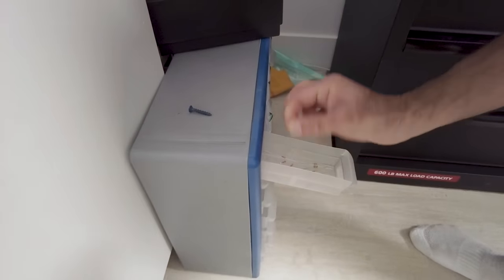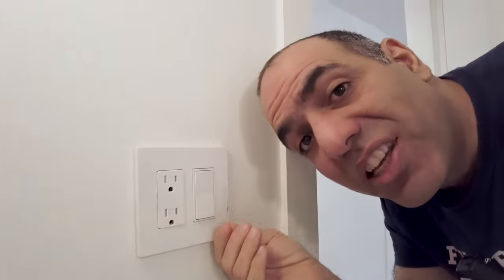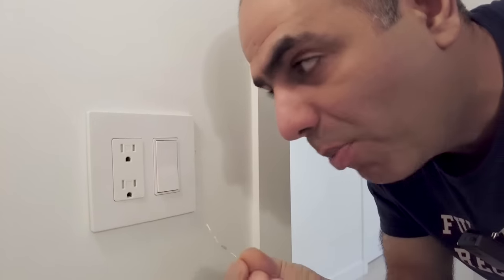It would be a pretty safe outlet considering new or renovated houses like mine have GFCI-protected outlets. I thought it was protected, but there is no switch — maybe it is. Let's test it. All I need is a 10 kilohm resistor placed between live and earth to create more than 5 milliamps of current from live to earth. And if this thing has ground fault protection, it will pop open.